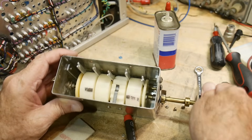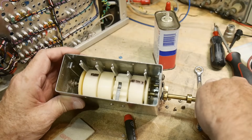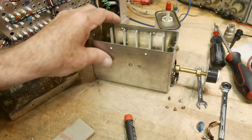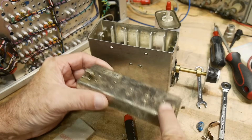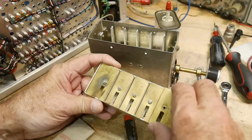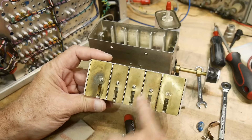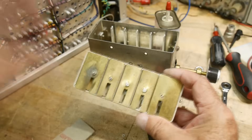This is just a big box of cams. Nothing special in there except for all these cams. You go all the way and they're all set to that one side so you can clock it correctly. They operate on this piece here — there's an input and an output on the attenuator, and inside are individual little compartments that each have an attenuator, and those cams go in and actuate those attenuators inside these cans.